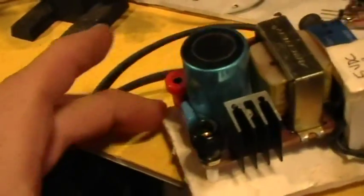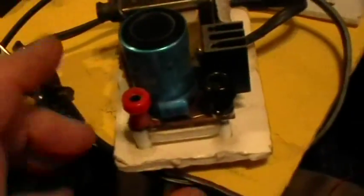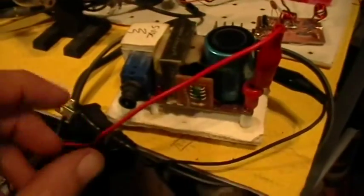So now what I'm going to do is we're not going to use the line cord — it's just there. What I'm going to do instead is take the output from that little power supply there, which comes out to these clip leads, and I'm going to hook it to the output of that little 5-volt power supply. And now I'm going to give it a little bit of voltage. You see that LED come on? And I turn the voltage down, on, down. So there's no persistence in the LED, or very little persistence, when I'm just turning the voltage on the power supply up and down a little bit.